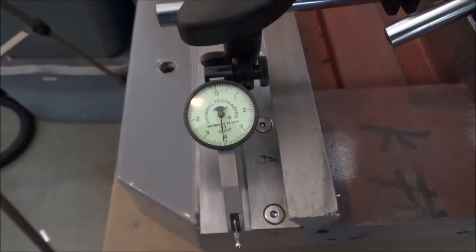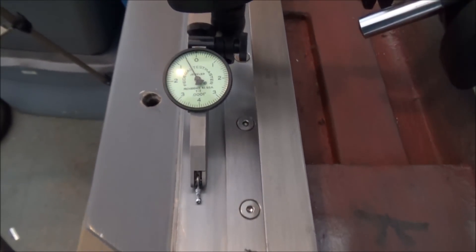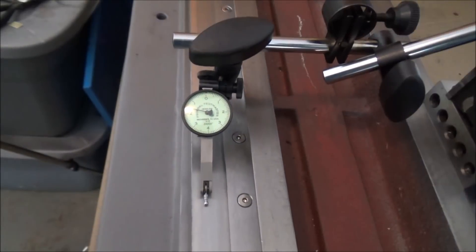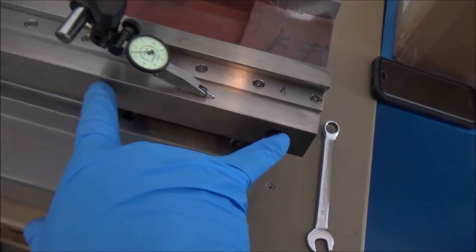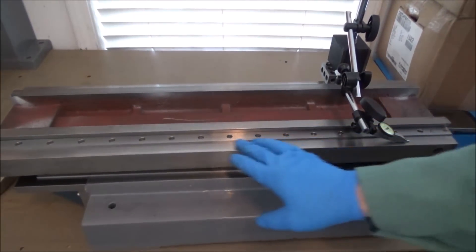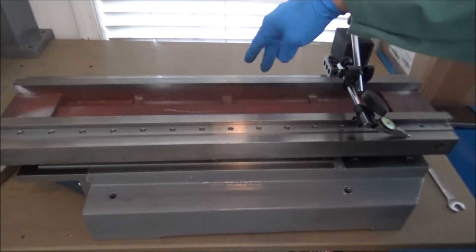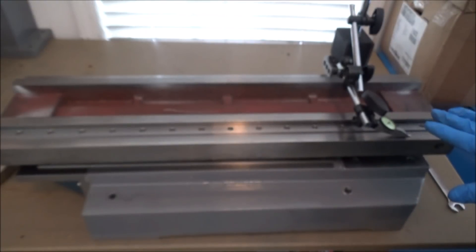You can see right about the last four or five inches there — I would say it's about 0.0015 to 0.0018 inches of variance, but it's mainly just on these last four inches here. So when I mount my rail I can just put shims along here and try to straighten that out. I'm going to do a bunch more checks — move from this side to this side, and also check from this rail just to make sure we're getting consistent results.